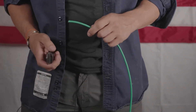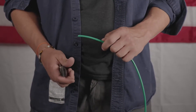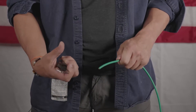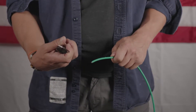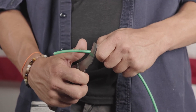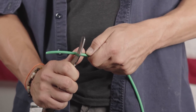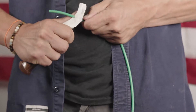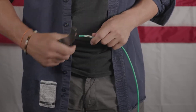I'm going to show you quickly how to skin it using the ice cream scoop maneuver — that's how I was taught. Hold on to it and use your index finger for stability on the back side of your blade. Then rest your thumb on the bottom side of the wire, put your blade into the insulation, rotate it about 45 degrees, and peel the insulation right off.